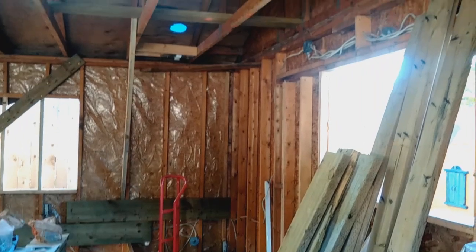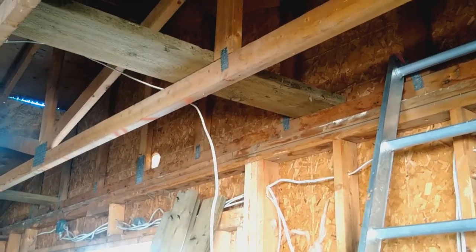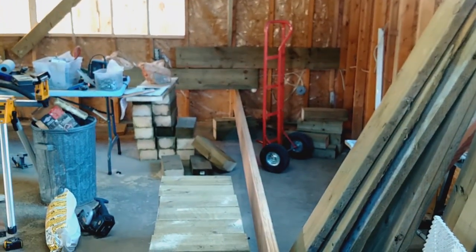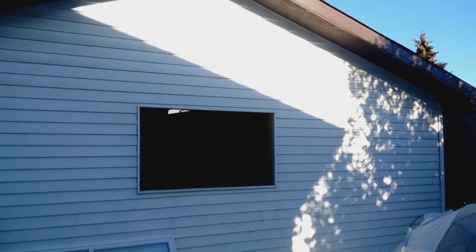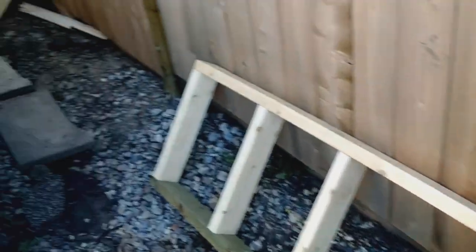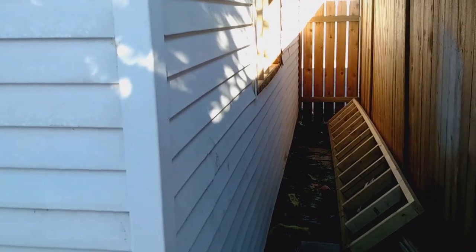Up in the rafters I lagged a 2x10 into each of the trusses, into the gable end, and down into the header. The concern is that the gable-end wall will start drooping during the lift since nothing is directly lifting it — it's just being carried by the side walls. I don't want it falling off prematurely, so those 2x10s with heavy-duty RSS lag screws should spread the load across the last few trusses, which I lined up with my lift points. The gable-end wall itself will eventually be removed entirely; the siding will be reused. You can also see the new concrete slab — it's going to be extended about seven feet to create a little workshop. The other pony wall is just sitting here waiting to go under when the lift happens tomorrow.